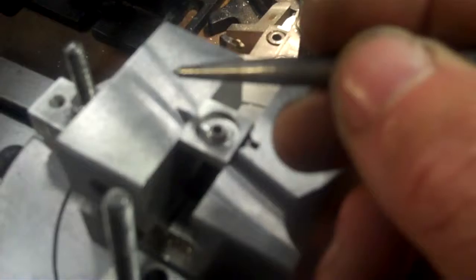And then I'll bring the edge of the workpiece, again keeping the X reference to the back here, bring the front edge here until it's flush to the face of this. Or no, better yet, since I've been drilling off this side here and locating off this side, I'll have to locate back this way. So I will drop it down, locating for the height with that pin, and then I will take my two locating surfaces that I've been using throughout this whole procedure, which is this right side where the X is at, and I will locate off the back side of this flush with this. Then I will set my vise to fit that, and then I'll be able to do all the machining and have everything located where it needs to be. You'll see what I'm talking about when I get it done here.